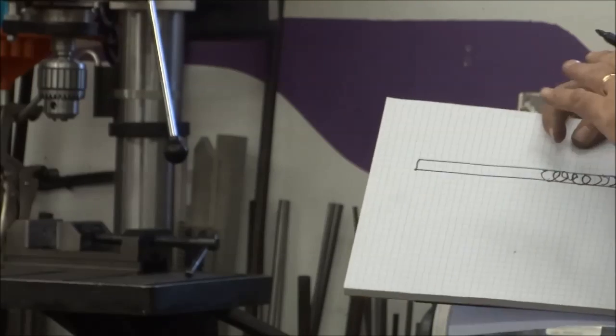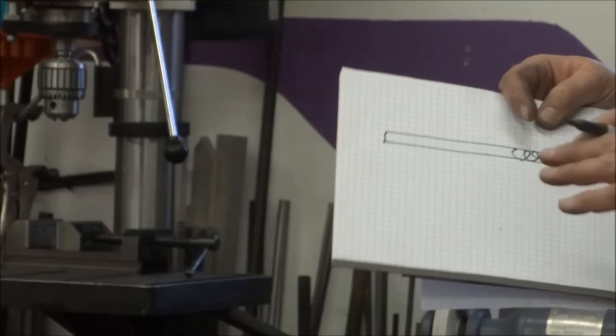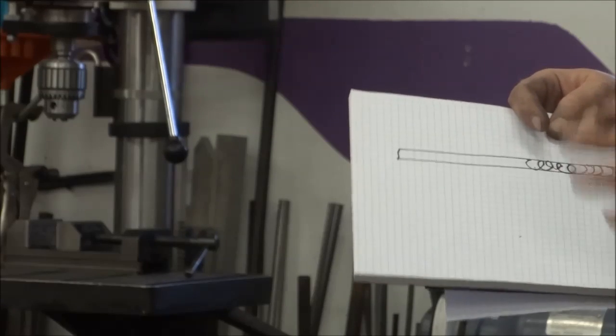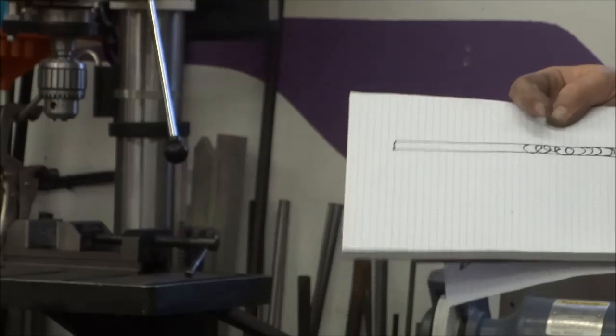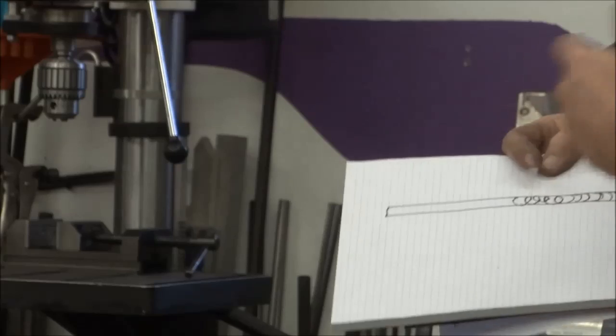It was different than what I had at home here. So the different welders, even the same brand, same series, can have a different inductance to the transformer, and they have their own personality. So I like to get consistent with a particular welder, and I've kept little notes. I do the same thing here.